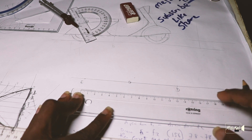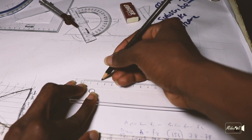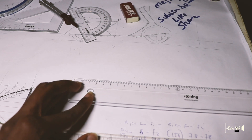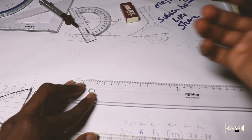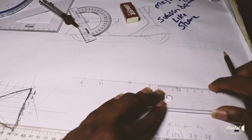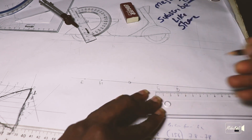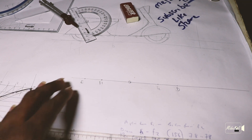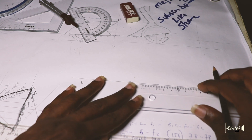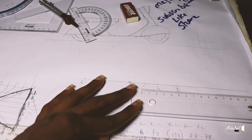We're told that from E to F1 was 2.5, which is the wall to where the mouth stops, which is our F1. We're never told F2, but always remember that F1 vertex measurement is always the same as F2 vertex, so we are going to be projecting 2.5 from D inward, which is going to be our F2 for the ellipse. For our C, we're told C was 4.5, so let's mark out point C at 4.5 — this is C, where the fin will be projecting upwards.